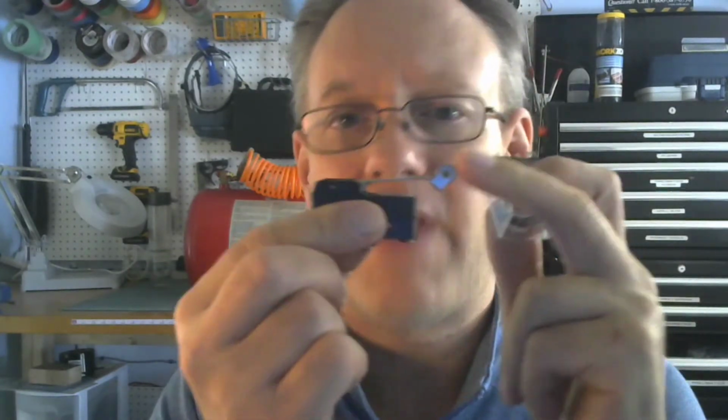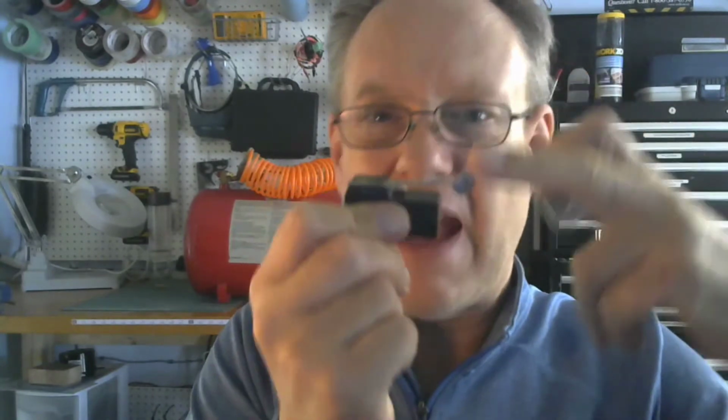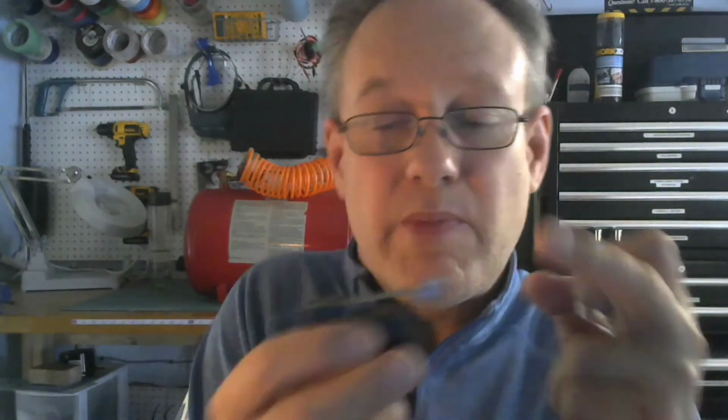Also maybe this particular relay is going to reverse logic for us. This is a really important point, because often we have a limit switch that's normally open, but when it activates something, we want to terminate something. So if this thing becomes activated, which means it's a closed switch, and I want to turn something off, what do I do? I can reverse the logic with a relay. Relays are so cool. So, let's put all this together and study some of the symbology and look at some examples of electropneumatics. So here we go.